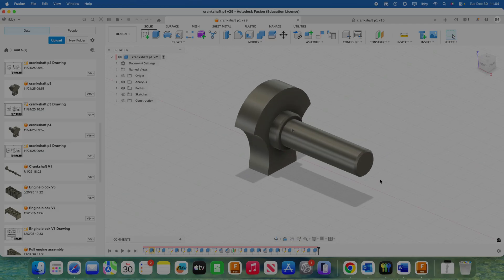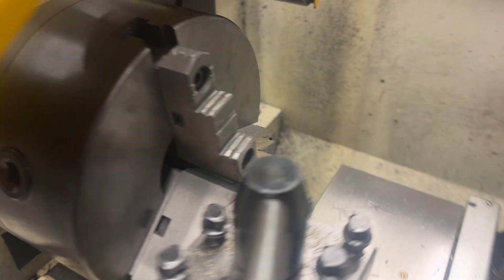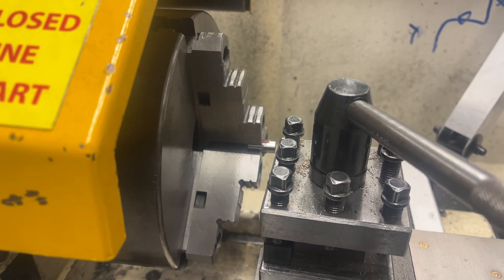What I decided to do was try to keep everything in-line as possible — everything that could be manufactured in-line should be. For the ones that couldn't, I completely disregarded the old approach and thought of a new joining mechanism. Instead of having those little pins at the bottom, I decided to remove them completely and cut a 10mm hole, then order 10mm cylindrical rods to just place inside. That way there's no offset turning — I can do that cut in a mill and it will still join exactly as intended. That simplified my manufacturing significantly.